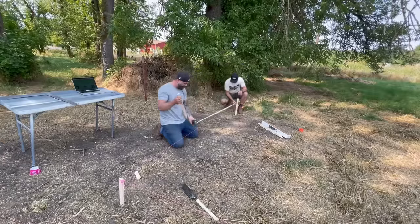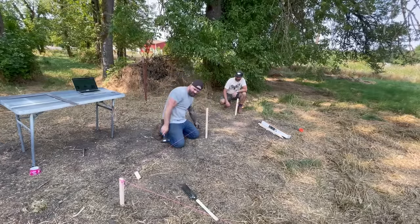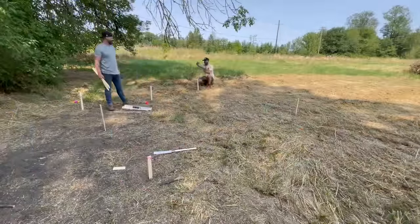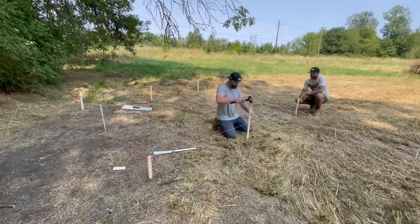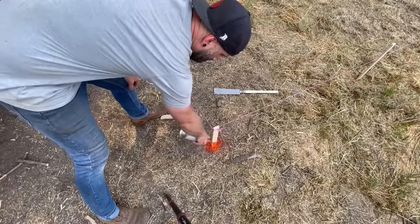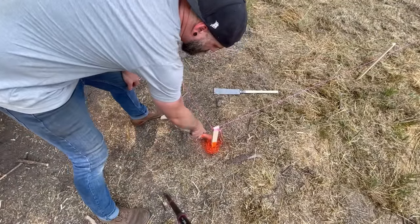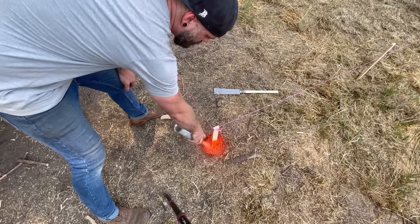Once I got my four outer posts in, I did what woodworkers do and measured diagonally from corner to corner to check if it was square. I don't know if this is the thing you do in construction, but it works in building boxes, so why not? Once I was sure that my four corner posts were square to each other, I measured to the center in between each post and added another stake, because you need eight concrete footers for a 12 by 12 treehouse.